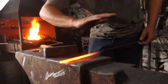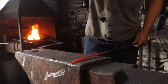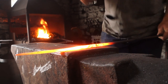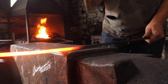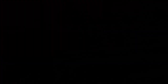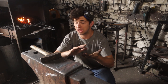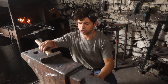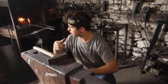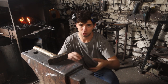I'll start by forging a taper on the end of the bar which we can then flatten to give us the profile of this leaf. Now that I've got the profile sorted on the leaf I want to give it a bit of a 3D aspect rather than it just being completely flat. So to do that I'm going to come in at the step of the anvil and just use the cross peen to force it in there giving it a slight cup. I could do this on a swage block or in a hardy tool, but it's just going to be just as easy to do it in the step of the anvil.